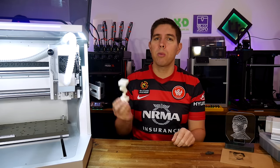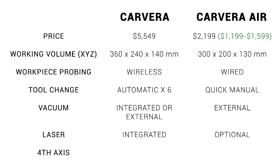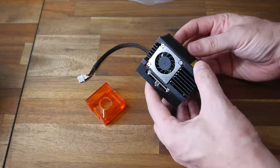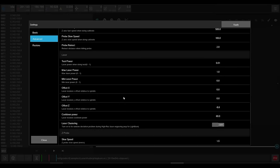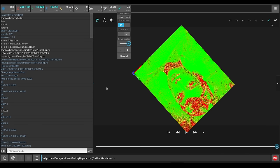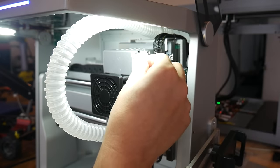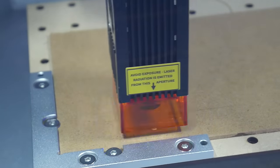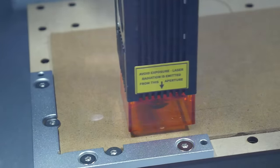The regular Carvera has a diode laser built right into the toolhead, but for the Carvera Air, money is saved by making this an optional add-on. It's designed to go into the toolhead just like a router bit would. Before we start, we have a one-time setup, taking note of the number labelled on the side — each laser module has a slightly different focal length. All we need to do is to come into the advanced settings and enter the value, which will be saved for all future use. After loading up the laser G-code, we load it into the toolhead when prompted, just like any other router bit. It is keyed so it can't rotate, before plugging in the cable to the port up the top of the toolhead. The tip of the laser will be calibrated like any other tool, before zigzagging back and forth, engraving the raster path. The included goggles are a much safer bet than the small orange shield, considering there's no laser filter built into the acrylic lid. The end result is pretty novel but this type of engraving is probably the limit to what it can do.